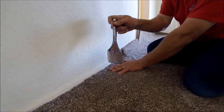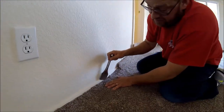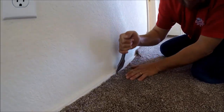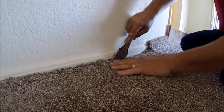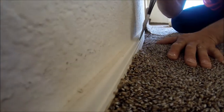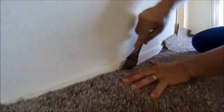If you've ever seen my videos, you always see me use my packer like this — most of the time not flat. I don't want the whole thing to touch the baseboard at one time; I want it to hit at an angle. I always have my stair tool at a little bit of an angle out, never flat. If you have it flat it's going to catch those lips. If I'm using just one side of it angled away, it's just going to slide up and down.